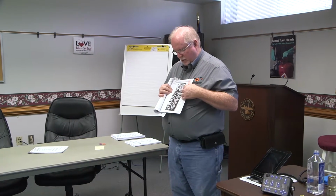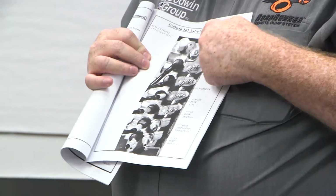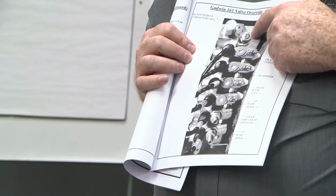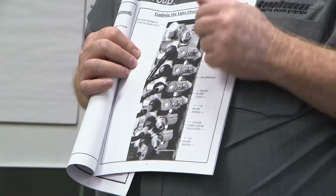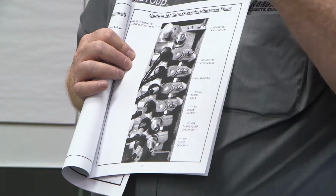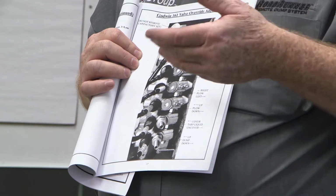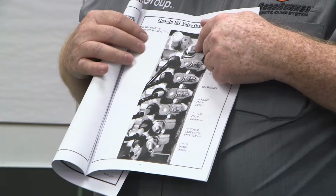Okay, hydraulic valves. Hydraulic valve, we put you a picture over here, and starting up at the top side of it, at the very top here, this is the main relief setting. This plug here is just that. It's an O-ring plug, a number 2, a 1/8 inch O-ring plug. Once you take that plug out, there's another Allen head screw down in there that you actually make the adjustment with. You're going to get a few drops of oil coming out of that thing, nothing to worry about. That's just residual oil to keep everything loose and lubricated. But that's where you make the main pressure adjustment.